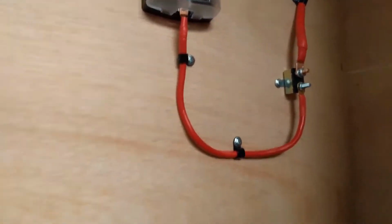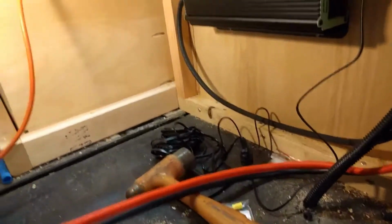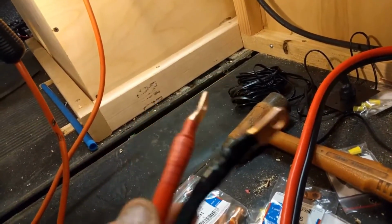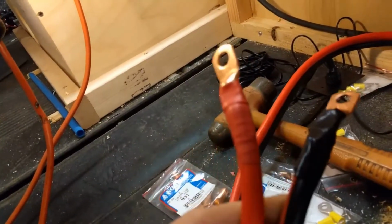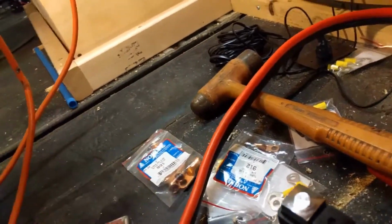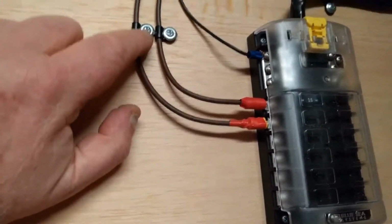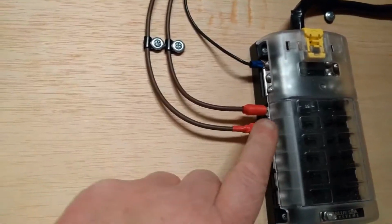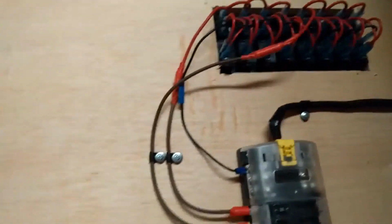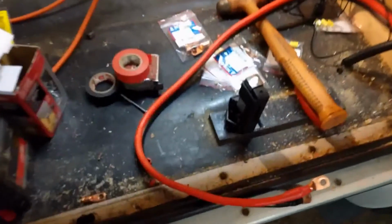We got all this in place now, and I was working down below here a little bit, and I put the ends on the wires with the new crimping tool, and it worked out pretty good. I always red tape the red ones and black tape the black one. If I happen to use a different color wire by chance, like I did up here, see I used a brown wire because it was the only one I had of that size. That's a 12 gauge wire. I wrapped it in red, and I wrapped it up here in red too. And I wrapped it up here in red, so you know it's a hot wire. But anyway, I'll show you how this little tool works.